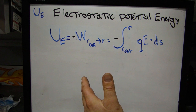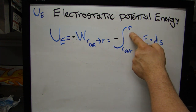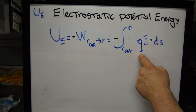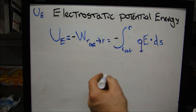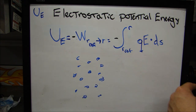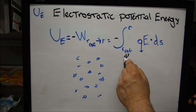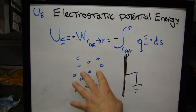Let me draw a picture to make it simpler. You pull the trigger on your gun and the air is filled with powder, floating in the air. You have your part hanging here, hooked to the ground. Right now it's just powder — there is no electrical potential, because it's just powder in the air. There's no electrostatic potential energy yet.